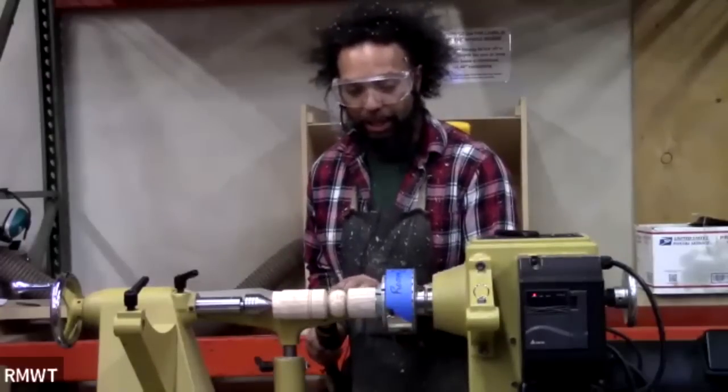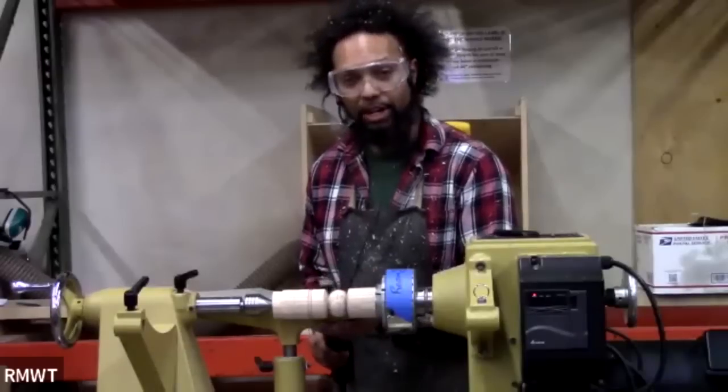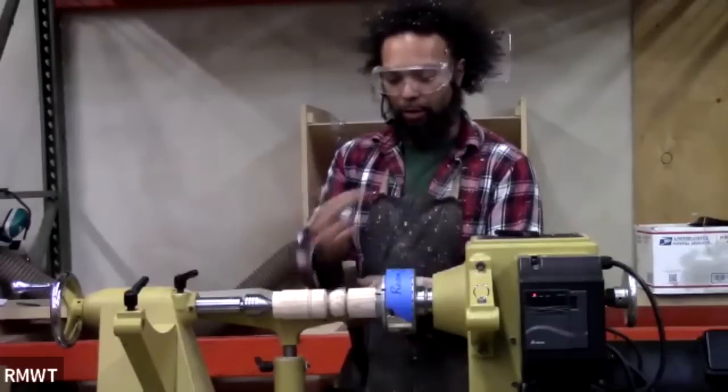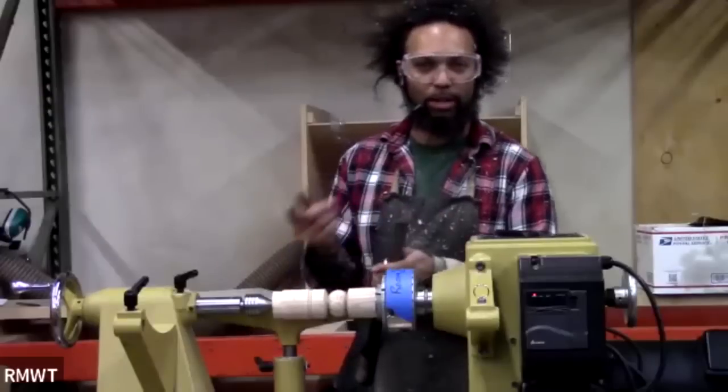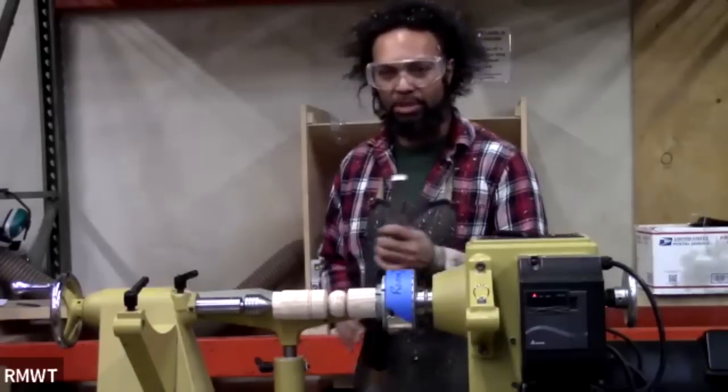I have to be careful that when I get up to the area near that long point, I keep the tool at 90 degrees and I don't ever over grind on that side. So I don't have a full sweep that looks more like a full round scraper, which is one of the profiles I have on there that I don't find to be savory.